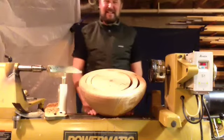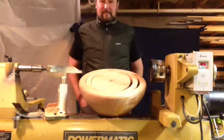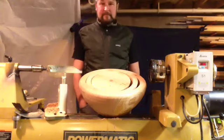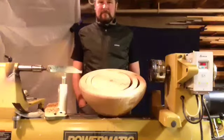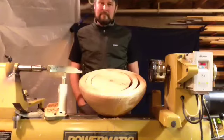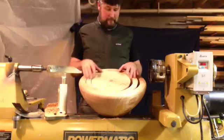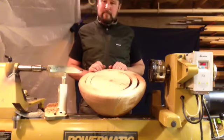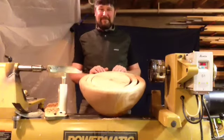Well, doing these small bowls first is more efficient, because if you do the largest coring first, then you have to go and set a tenon on it and so on and so forth. It's each his own, but I always core the small to the larger, and if I miss, I miss. But from an efficiency standpoint, it works.